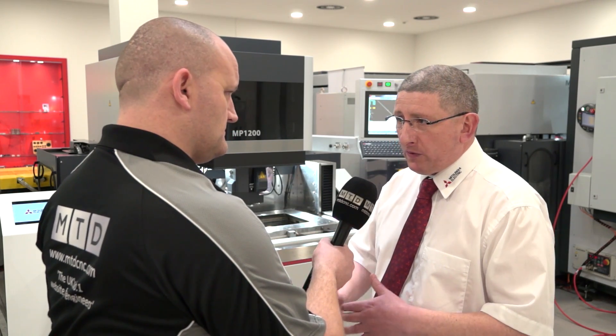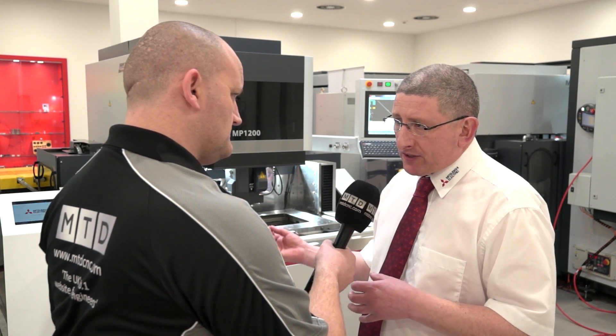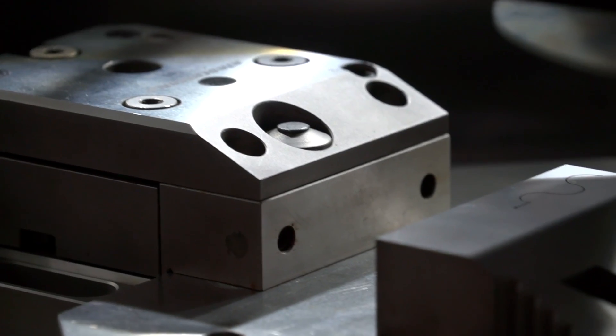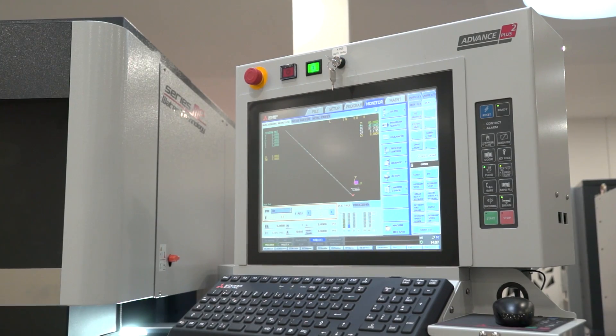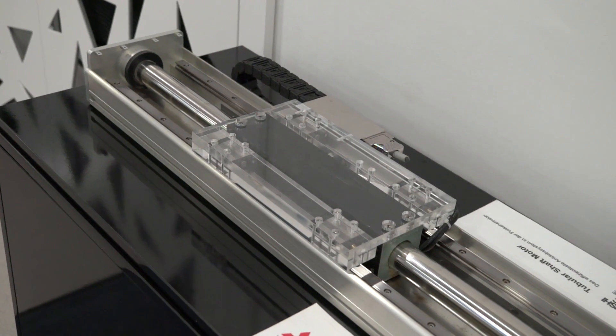In the Z-axis, the digital fine surface we have on the MP has a higher frequency — this is a high speed digital fine surface. We can increase the height of the fine surface up to 100 millimeters, going down to surface finishes of RA 0.1 to 0.15. We're just upping the ante with this particular machine.